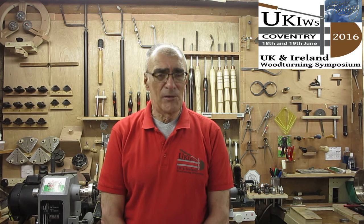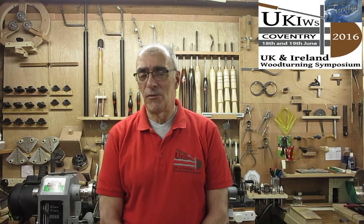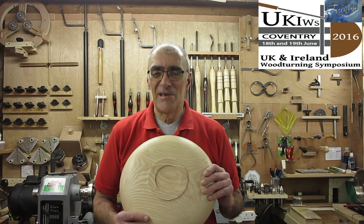The reason I didn't put it up there and then was because I felt the video would have been too long, and it gave me a bit more time to experiment with various things. If you remember, if you watched the last video, the bowl I finished sanding up to 600 on both sides, inside and out, and didn't apply any sanding sealer or any form of wax or anything, just left it like that. The reason for that was I thought possibly the finish I am going to apply would have benefited from that, but in fact it benefits from putting sanding sealer on.